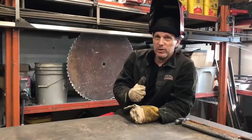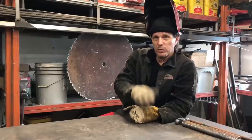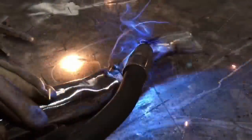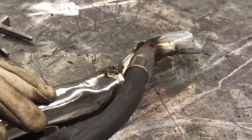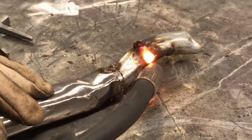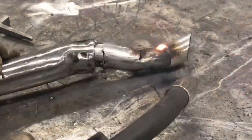However, as long as your penetration is good, you can do multiple layers of texture over top of it. Rather than just weld on this thin edge of pipe, what I do is I'll actually start a tack so I have some additional thickness of metal to start welding from. I'll go ahead and do an initial tack and build that up, and then my next weld will be on the existing tack weld and just keep stitching from there. Plus, it gives me different textures, and I'm able to do different circles or figure eights or whatever I want to do to help give me the textures I'm looking for when I go to sand.